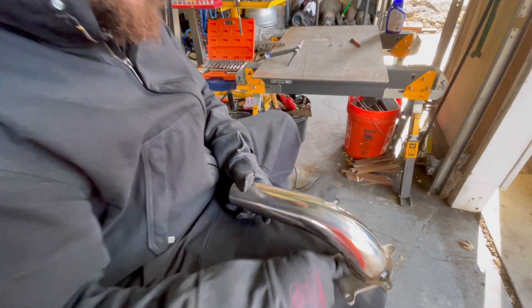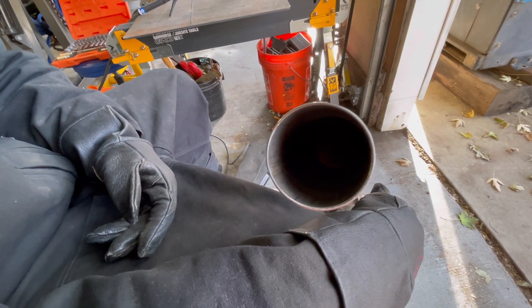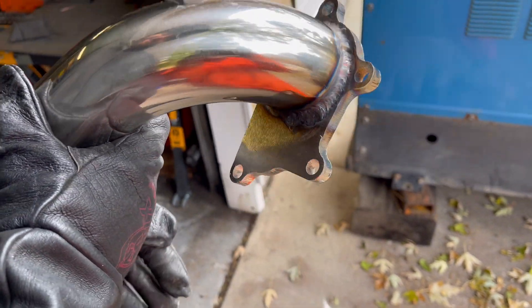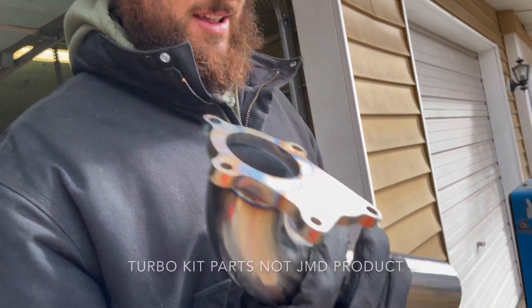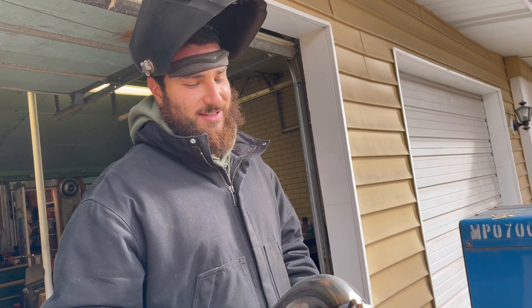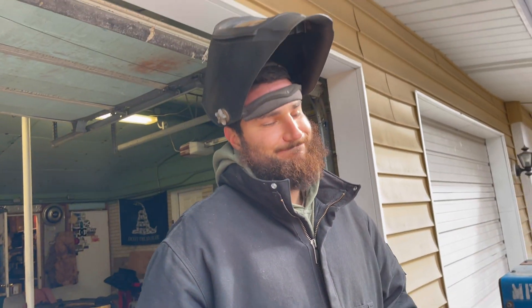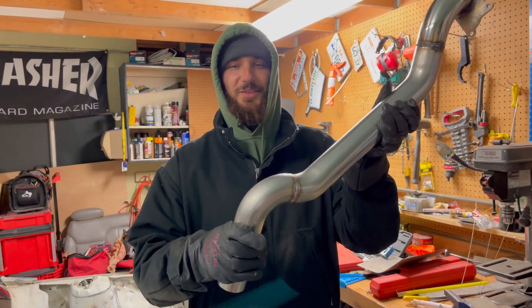I'll just cruise around in different spots, watch my heat — it's a little tricky because of the thickness of this plate compared to the thickness of tube. It's welded — what a battle. Why was it so rough? Because we got a quarter inch plate of who knows what welded to some stainless down tube. If you know anything about welding, you look at that stainless — it's a bit sugared — and that's because of the amount of heat needed to get it to bond. Turbo downpipe mounting plate — that's what we've got so far.